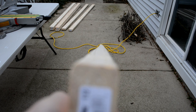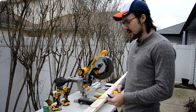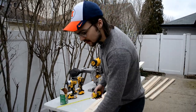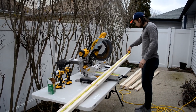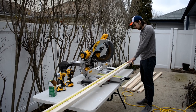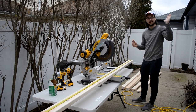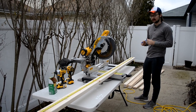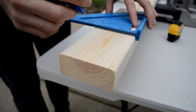We're going to start with the size of the fireplace and build some stud-framed walls. Our first measurement is 93 inches — this is already a factory cut edge so we can use that. These are 96-inch studs so we're only cutting off three inches. Our ceiling is 8 feet but we don't want to stand up the wall and have it hit the ceiling, so we're going just beneath that. We've made our mark with the tape measure.